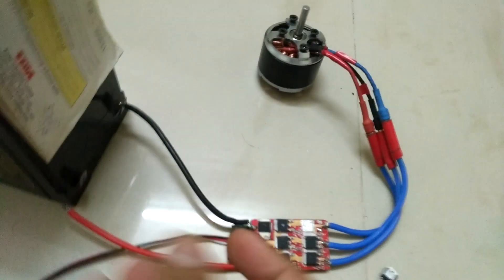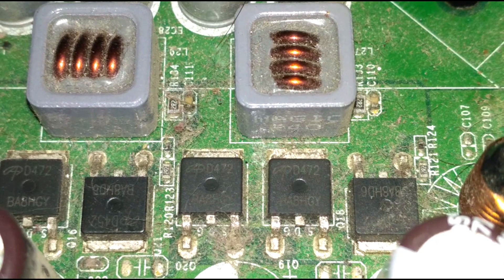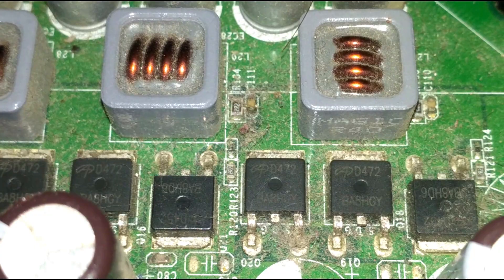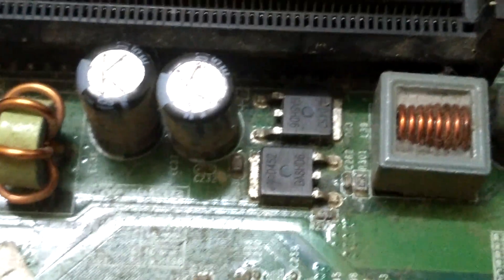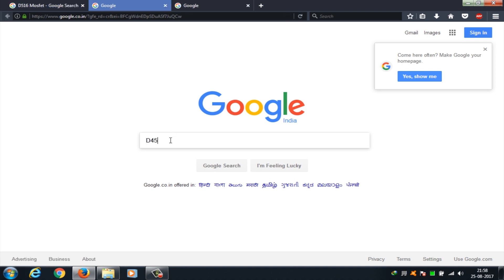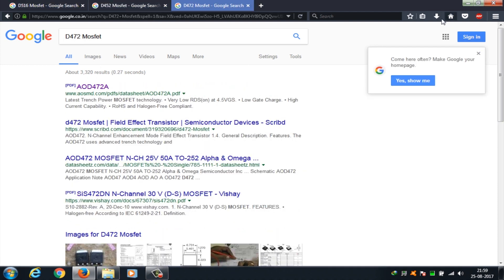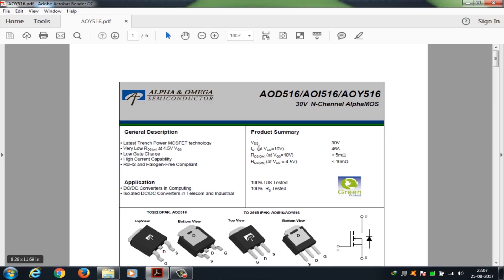Just testing to make sure I haven't damaged anything else. Step 3: Get replacements — at least two. Since I had some old scrap motherboards lying around, I searched them firstly for visually similar MOSFETs, and then I used Google for the datasheets of the MOSFETs. Let's compare them and decide which one would serve as a suitable replacement.